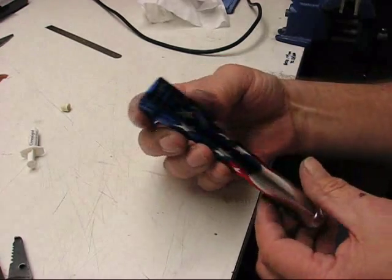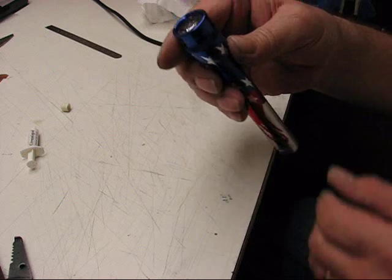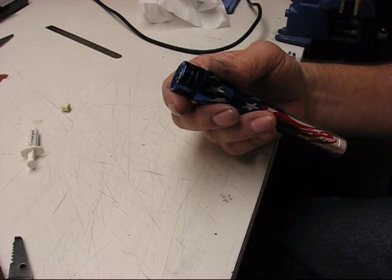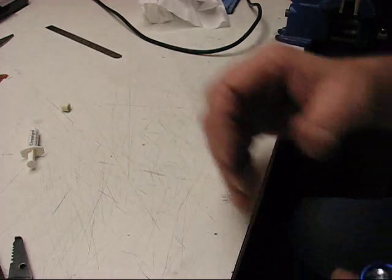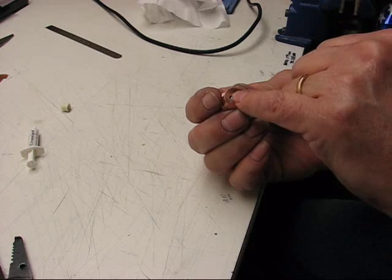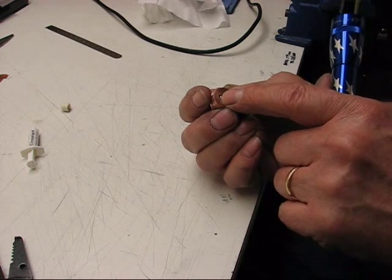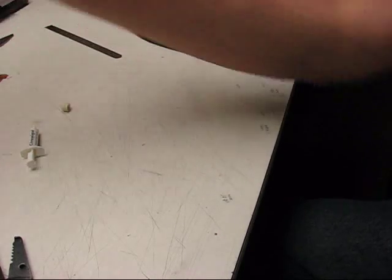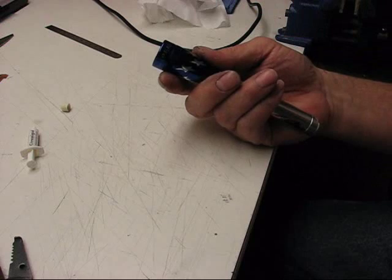That's a 2AA mag light — incandescent turned into an LED — without having to do any boring or drilling except two holes for the wires and one hole drilled in the copper round so the plastic insert seats inside. You don't have to drill it that way; you could just glue it flat on, but I want a little lip to help hold it together a little bit better.